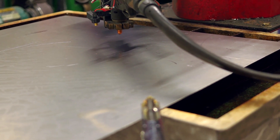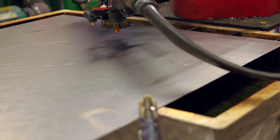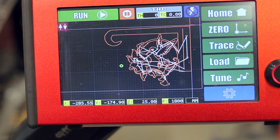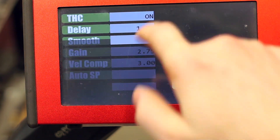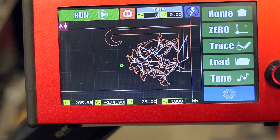When you're setting these up, you just use the same origin point. I split these up into two files because it's easier to deal with, especially on the ArcDroid. After I cut this one out, I can just load the left-hand file — my zero point stays the same, and I can cut that one right after this one's done. I've got torch height control enabled. We'll see how that works out. Let's get on to the cut.